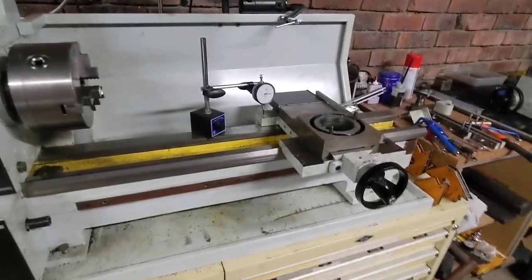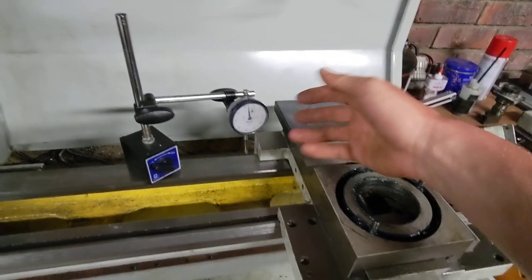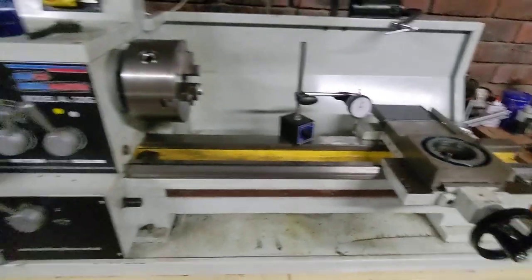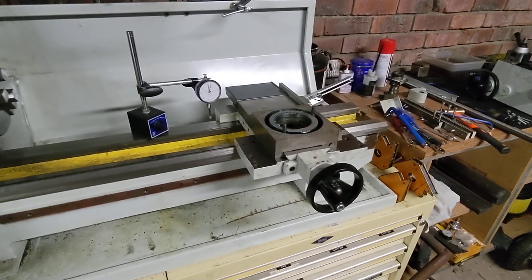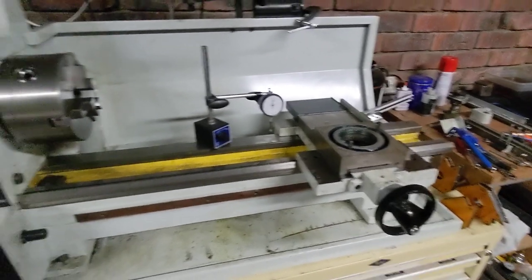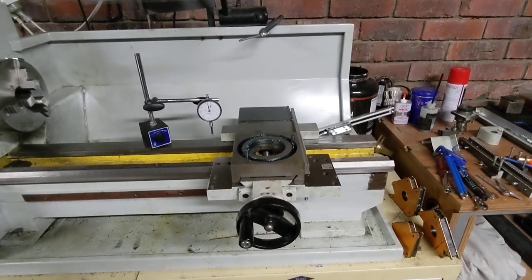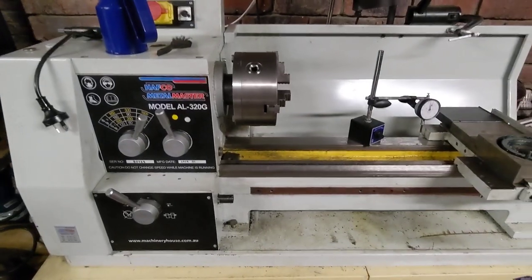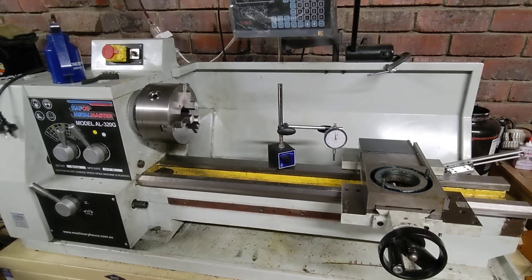Hopefully this will all come good. I've just got the indicator on there and it moves pretty nicely at the moment. I'm just trying to adjust it up so I get minimal up-down movement on the back while still keeping free left-right movement of the carriage. Thanks for watching — just that very small update. When I get around to it I hope to create some videos on the stuff I'm actually making. Anybody who makes stuff and puts it on YouTube already knows it's quite a chore. I'm just trying to get over that motivational hurdle of taking all the video, putting it together, cutting out the rough bits, and throwing it up online. Thank you for tuning in — hopefully I'll put up some more material soon. Cheers.